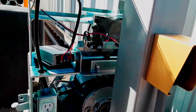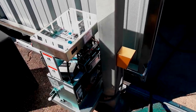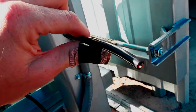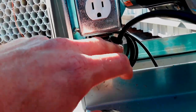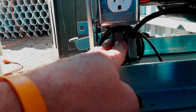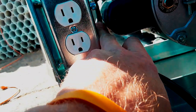We'll mount a strap here that covers the coaxial cable for the long-range antenna kit - that'll be the head side, the transmitter side. Then we've just got a few more things: programming remotes and testing the gate operator. The conduit is anchored down and I have an 18/4 direct burial wire pulled, and I've zip-tied the conduit to the bottom of the electrical box. We're not worried about interference - we just have power and a relay, no data that could be corrupted by the electromagnetic field that 120 volts puts out.